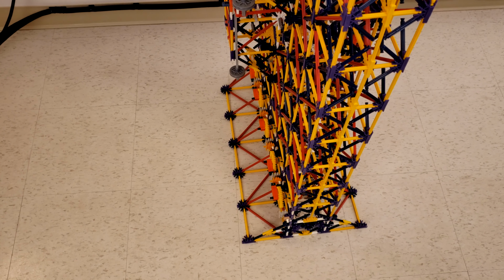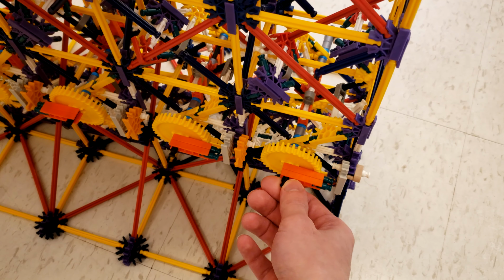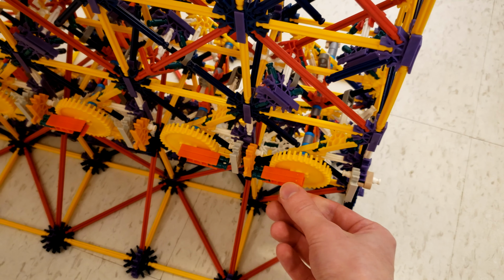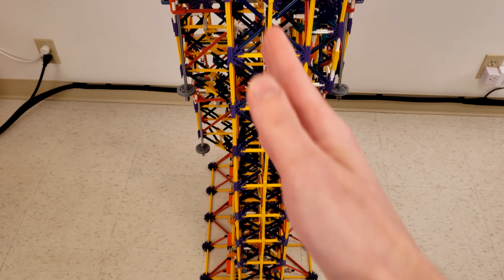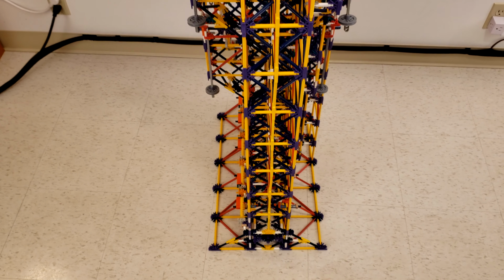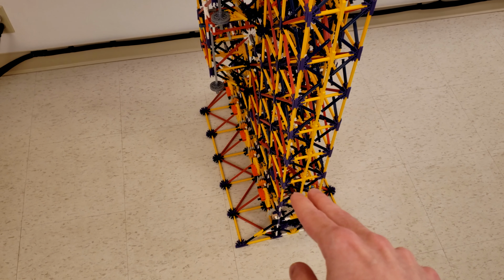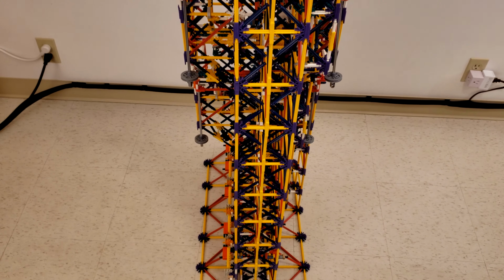But now you need to worry about the zeros because they set these dials one way or the other, depending on whether a ball falls on this side or the back side of those little ramps you see. And you also need to make sure that the discards don't get in the way of the zeros, because before, all of the zeros and discards just went down that column right about there. But now we need that space for all of the 10 channels: two values, 1 and 0, for each of the 5 bits. There are 10 areas where the ball can fall, and you want to make sure the discard doesn't get in the way of any of those.